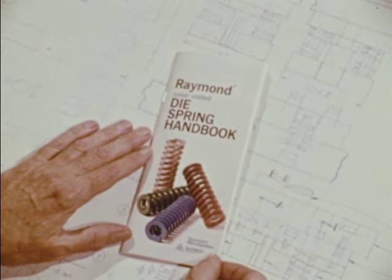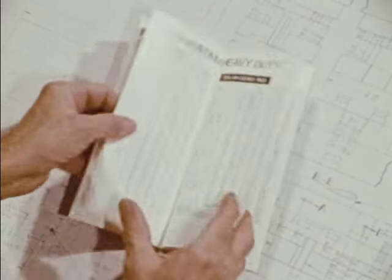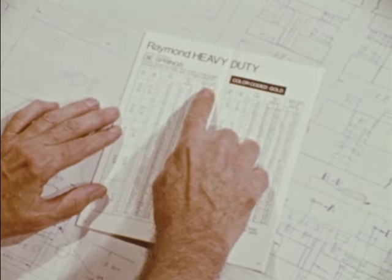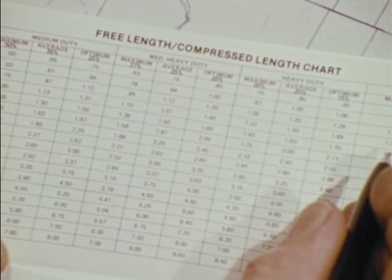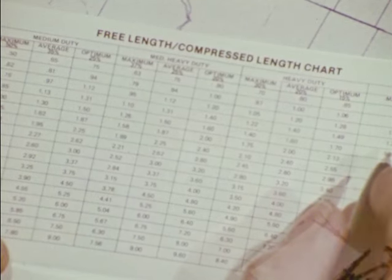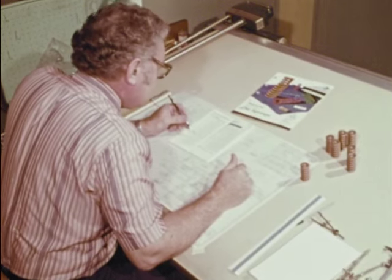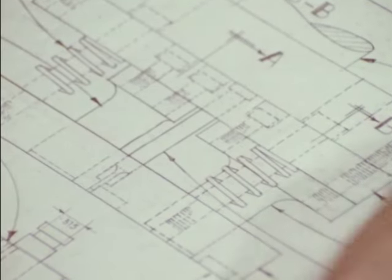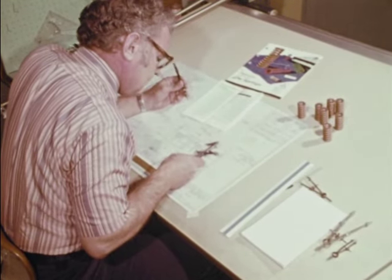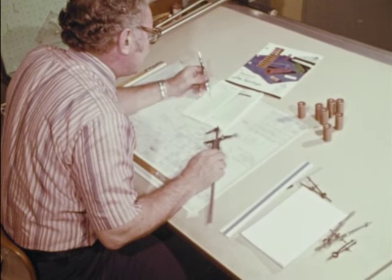The Raymond die spring handbook is a very valuable tool for everyone specifying or using die springs. One method of selecting the correct Raymond springs for the job is to choose from Raymond charts, giving the pressure pounds per one-tenth of an inch deflection and at maximum deflection. Another spring selection method made possible by charts in the Raymond die spring handbook is to work from the amount of operating travel the springs will be subjected to as indicated on the tool drawing. Refer to the handbook and select springs in the correct duty range to operate efficiently at the recommended travel. Calculate the number of springs needed by working with the pressure pounds for a single spring indicated on the chart. A good rule to observe in spring selection is to always make it part of the original design project — do not wait until after the die is designed to choose springs and decide the number to be used.